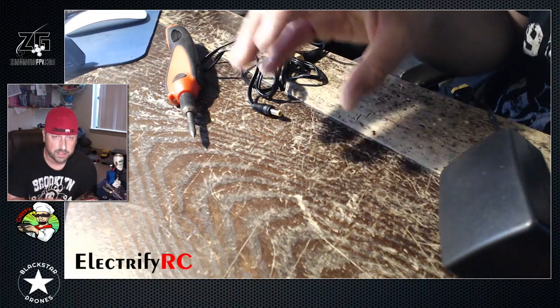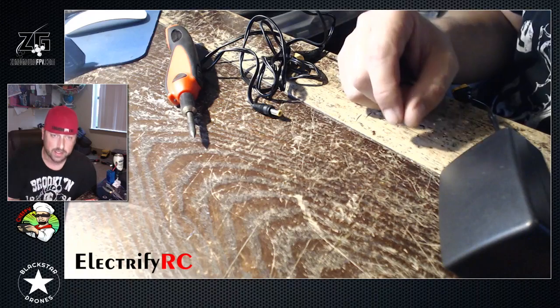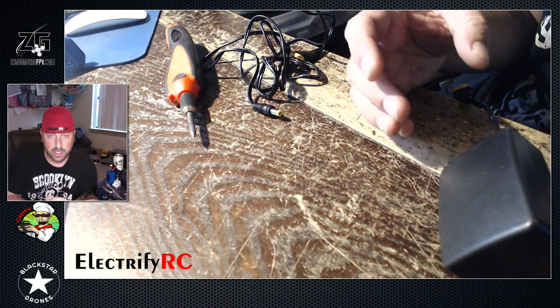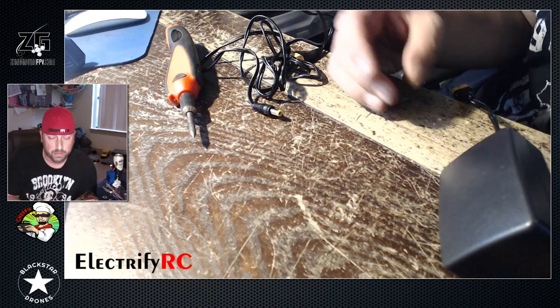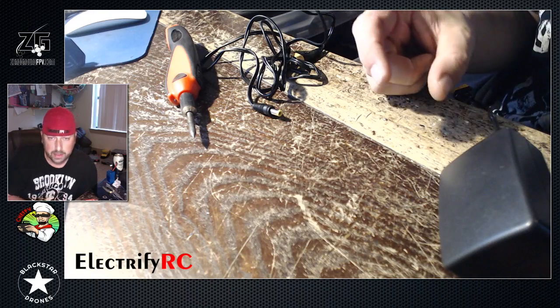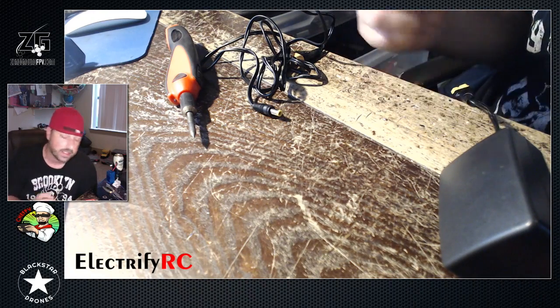You literally use the heat from the tip as you solder — every time you take solder off it takes heat, every time you touch wires it takes heat. The amount of wattage determines how quickly and how stably it can keep the heat as you solder. So if you're having problems getting solder to flow, it's probably because it's a low-watt iron on a high heat-dissipating load, like a large 12-gauge wire or a big brass fitting on an XT60.